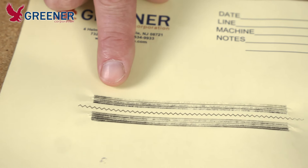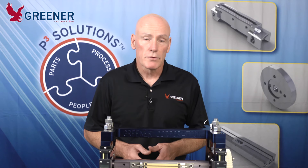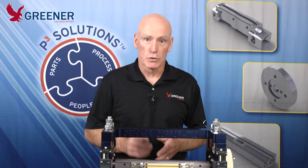Carbon paper is a critical tool to use during your initial setup, but it's also a very valuable tool to use for troubleshooting — to ensure that the jaws are balanced and level before you make any adjustments. So be sure and put carbon paper in your toolbox.